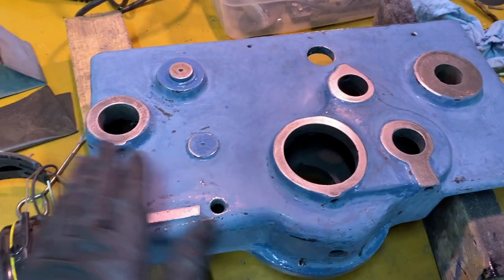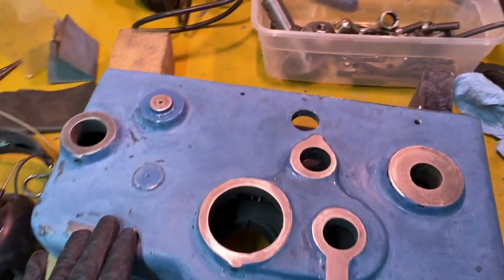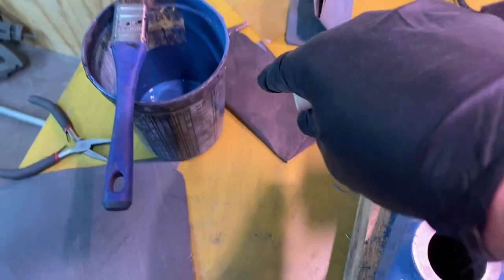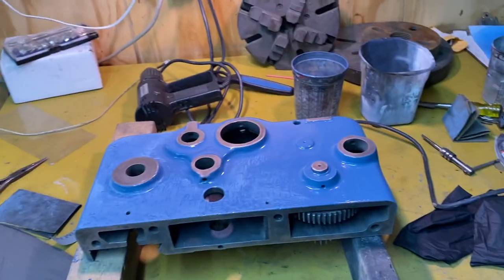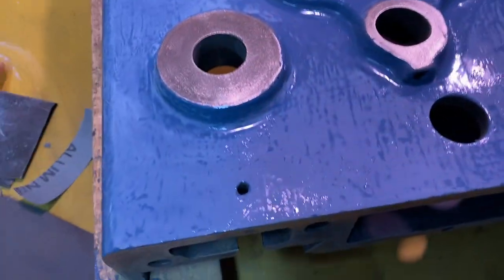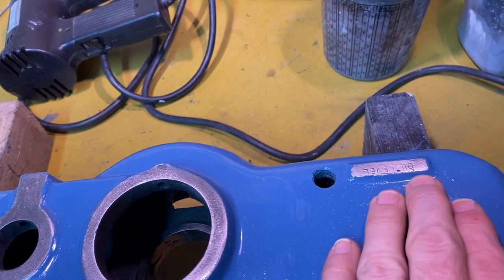I couldn't handle the little ripples, so I hit it yet once again with sandpaper. When am I gonna just leave well enough alone? I put on another coat, put two caps of acetone in there to make it really thin so that it would run and fill in, and then I used this to smooth it out. All right, here's what I had hoped to be my last coat of paint. I started doing some fine 180 grit paper. Kind of knock the surface off the top, try to make it smooth. Like right there, I can feel it being rough.